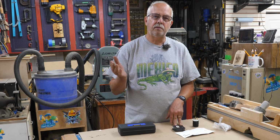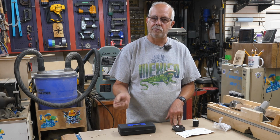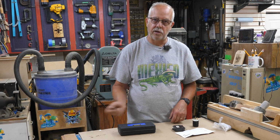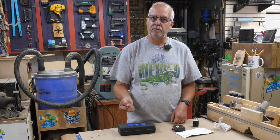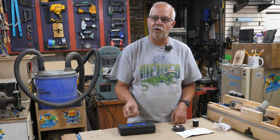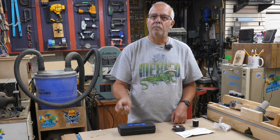Again, I'm going to get some feedback from other electricians or other people who say, well, I just tighten it up till it's tight. I did that too for years and years and years. And then recently, actually just before I retired, they came up with torque specifications that have to be adhered to, even if it's something as mundane as a switch or a receptacle in your house or in a commercial building or a business or whatever.